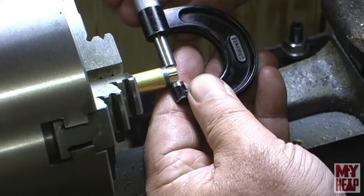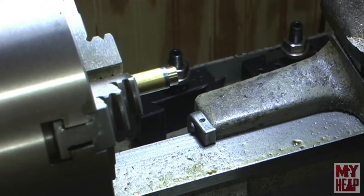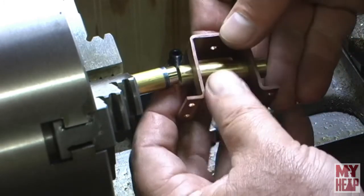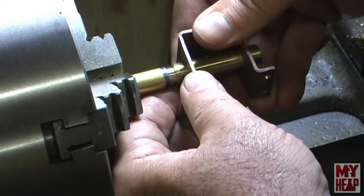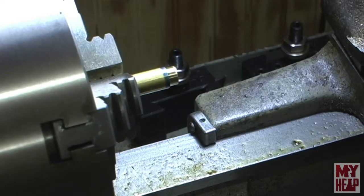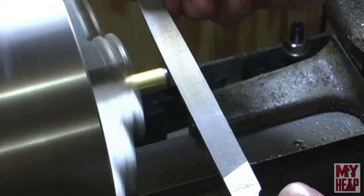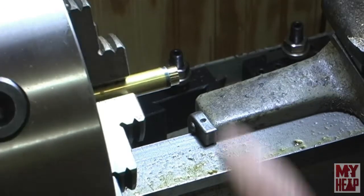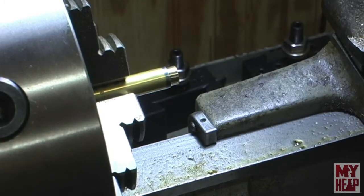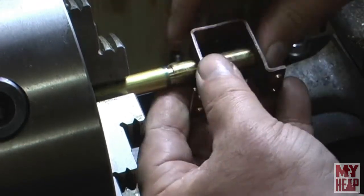The pump barrel was reamed at 0.375 or 3/8 of an inch, and it looks like I'm at 0.376, so that would technically be a press fit. It's just wanting to start in the tube. I'm going to lightly touch this with a file - notice I am using the handle there - and that's a nice firm fit in the tube.